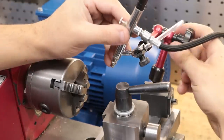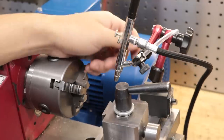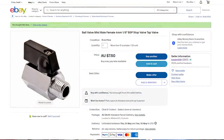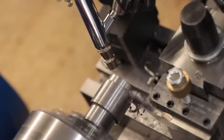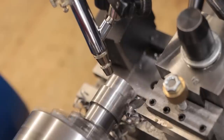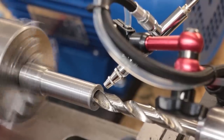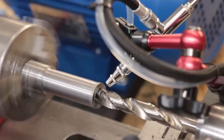For the final setup I've decided to keep it connected to the mag base, because it allows me to quickly swap it in and out and very easily adjust the position. Now because I have the airbrush permanently turned on, I'll have to use a ball valve to turn it on and off. Unfortunately the ball valve hasn't turned up yet, but when it does I'll add it to the setup. With very careful alignment, the coolant is being sprayed directly onto the workpiece with only just enough coolant being used to keep the part cool. I'm using so little coolant that I should be able to go weeks or even months between filling up the reservoir, and it should only cost about one or two bucks every refill. The workpiece and the chips coming off are a lot cooler, which should protect me and the new way cover.